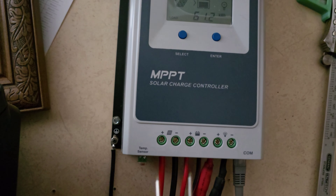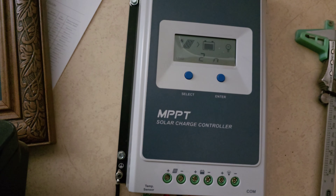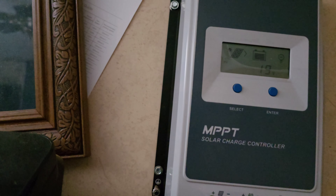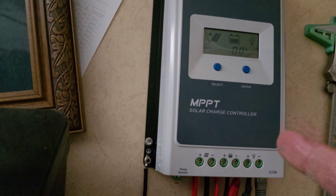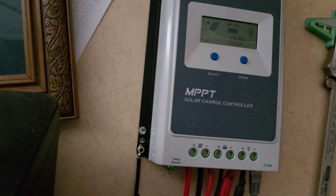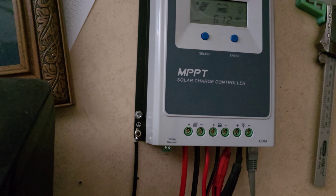Just for reference, here's my actual MPPT charge controller — much more expensive. I've got a number of 12-volt panels coming into this. It says right now it's 19 volts in, but only 13 volts coming out. So there's much more power coming into this, but only 13 volts coming out. I think we can safely say the charge controller I've been trying to use is an absolute piece of junk.